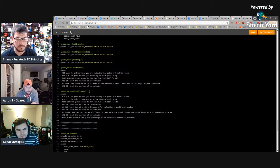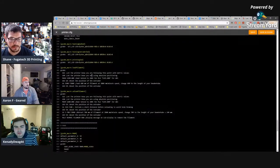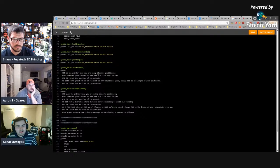Perfect. Okay. So the G21, I don't know if Klipper actually supports that or not. Okay, I can pull it out. I literally just copy and pasted this off Bondtech's website. I don't think you need that, so you could probably get rid of that, but the rest of it looks fine. So it's doing G90, absolute positioning. I don't need all these in here. Does a semicolon comment out, or does it have to be a pound sign? It has to be a pound sign, I'm pretty sure. You can do a semicolon. No, it'll comment out everything after it. Yeah, if it's in a G code macro, then semicolon should work.